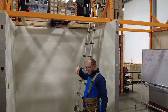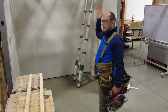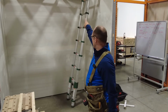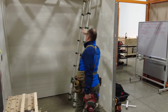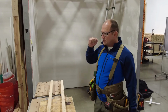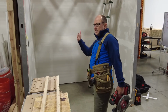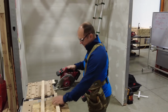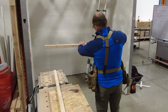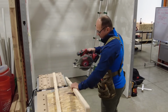So when you're the cut person down on the ground, you'll probably be cutting all day. And the other person can take all the measurements, then they can be the installer and install everything. There's no reason we shouldn't have all these measurements marked like that. I pop the lid up, worst case scenario, I just look at my measurements, right? That also helps because you might have hatches that are 22, 22 and a quarter, 22 and 3/8. So when you bring your material up, you don't put it by the wrong hatch, get up there and be like, oh, it almost fits, right? So when I do this, I mark the top, but I'm rolling it to me because I want to see my line when I cut it, right? Because if I go like this, I'm still guessing 1.5 inches. It makes it easier when I go here.